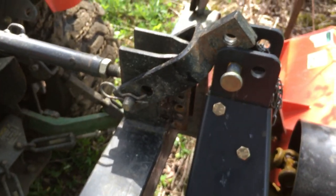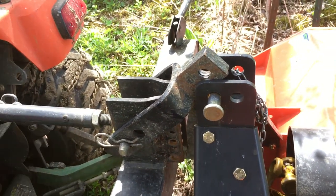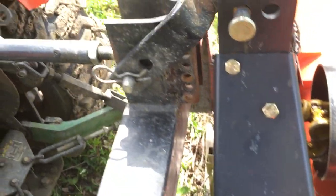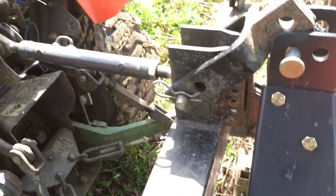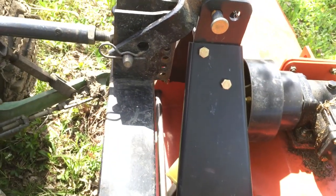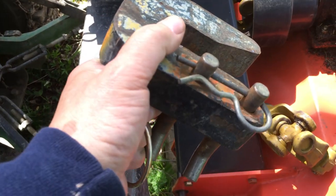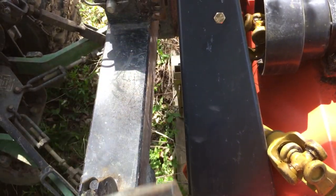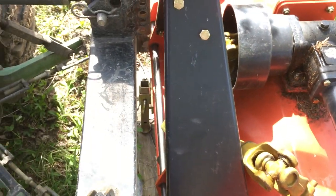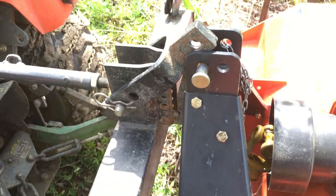This is how you mount one of the quick hitch arms - every dealer I've ever seen gets it wrong. The arm goes back to the top link pin, slides over it, flips over. I use my hook. Those bolts are stupid - I drilled it out, got two trailer pins from Harbor Freight, and just clip it in. It's easy and the quick hitch is even faster.